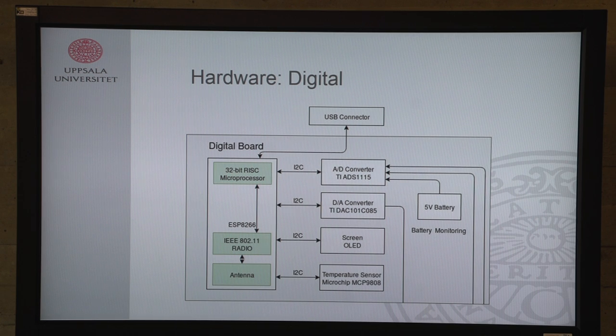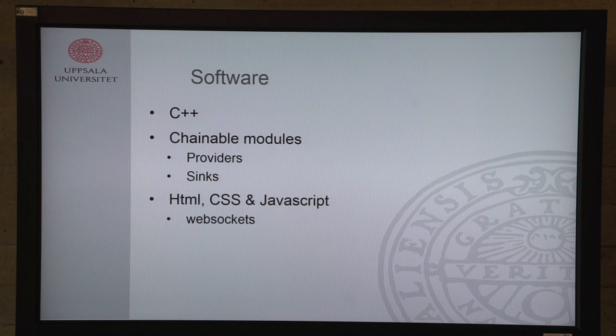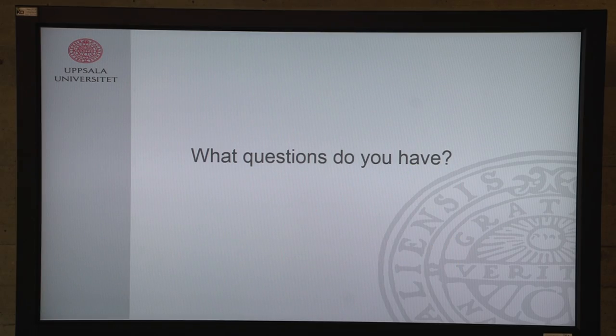We've got four off-the-shelf components. We've got the analog-to-digital converter from TI, which will read everything out, and a digital-to-analog converter for the constant current source. Then a little bit about software. Everything is written in C++. It's really customizable, tailorable to what the user wants. We've got a web interface, with HTML, CSS, and JavaScript to display everything, and all the data is transferred via WebSockets. And first, I want to show the sponsors. These are our sponsors. Are there any questions?